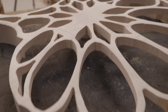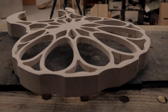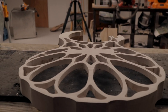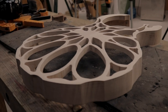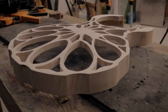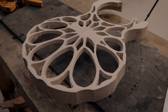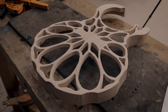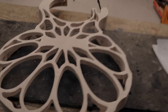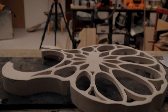The camera's a little bit dusty. All right then, this is looking pretty awesome. And I'm very happy. So, you can see that what I tend to do is angle grind, which is relatively rough, especially when you have the safety guard on. It tends to get in the way and it means I don't get quite as clean cuts as I would normally like. And then I go back later with the random orbital sander, and then that allows me to sort of normalize the shapes and sort of smooth it out.